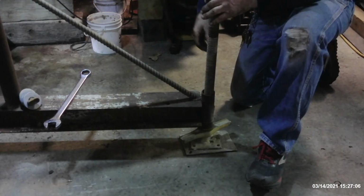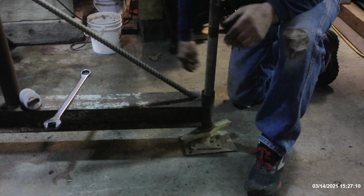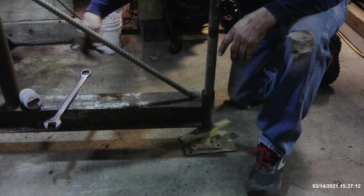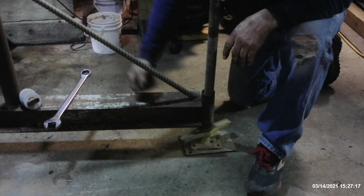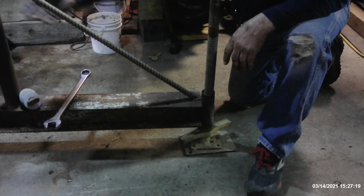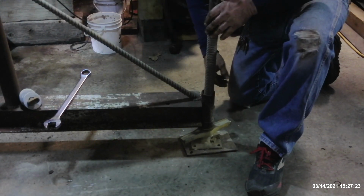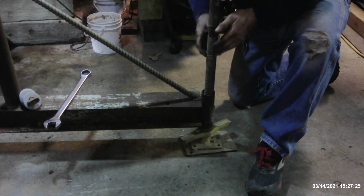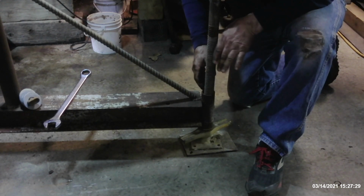My brother and I make almost everything that we make off of construction debris, just things that come off a job site. It's just a scrap piece of little 4-inch I-beam. I actually butt welded it together in the middle, with an old piece of gas pipe, a piece of rebar, whatever, and a piece of angle iron. And then these here are discarded scaffolding legs right here. They're bent or whatever. You have to warm them up and take the bend out of them and everything.